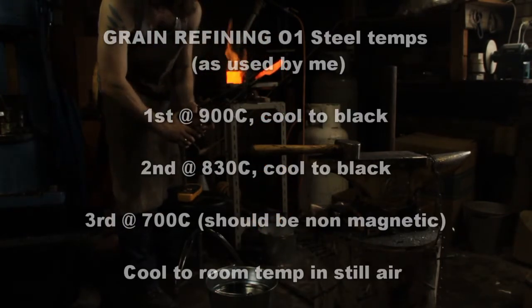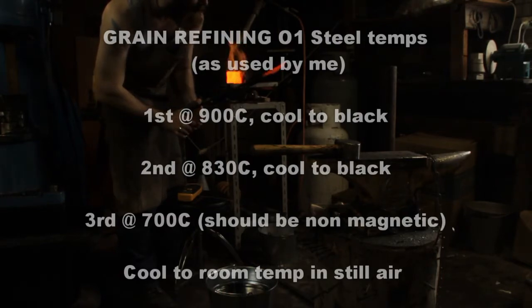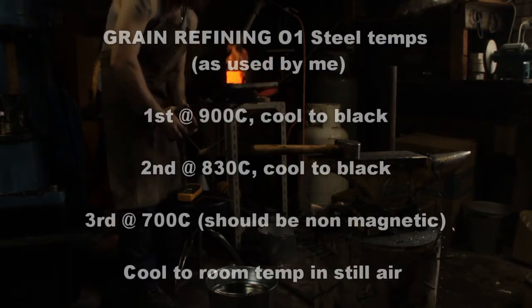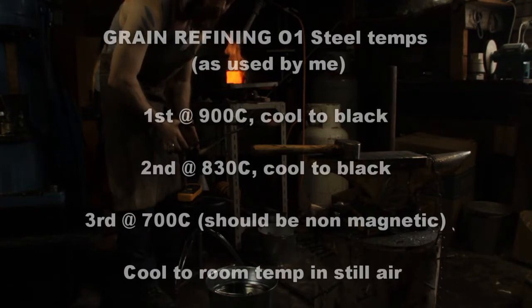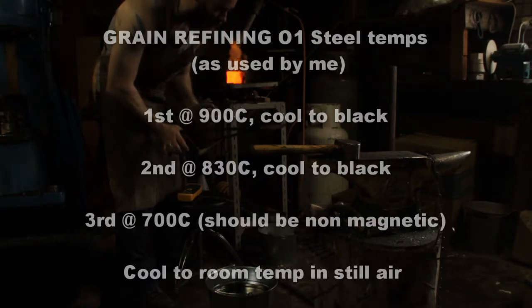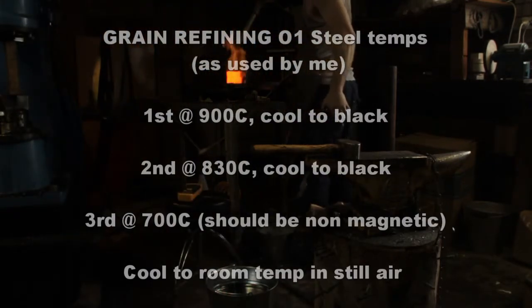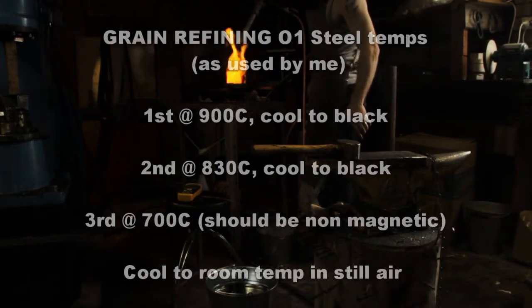Now the piece that we're actually going to put some effort into fixing up after all the forging — I'm going to let it cool in air down to black. Best practice is to go from above the critical temperature for that blade steel, then around about the critical temperature, and then one below for your three grain refining cycles. I tend to wait until the steel's black and then go in for another heat. Hopefully we'll be starting to homogenise the grain size by letting it cool down this way. I'm going to reduce the temperature of the forge now, cutting off the air a little more.